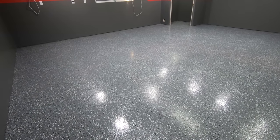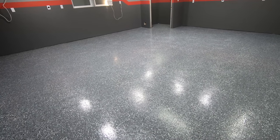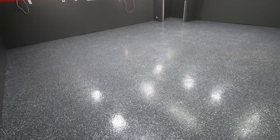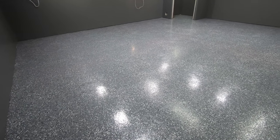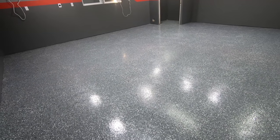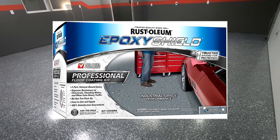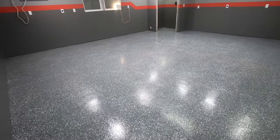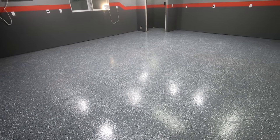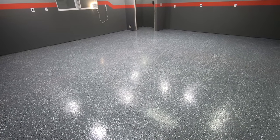First, I'll talk about the prep. When you want to tackle a project like this, the most important thing is the prep. We spent several days prepping the concrete before we actually got to the fun part, which is putting this down — so definitely be prepared for that. Second is how much product I used. I used just one kit for this entire garage — it's a bit over 400 square feet, about a 22 by 22 foot garage. But I would probably advise buying another kit anyway, and if you don't use it you can return it.